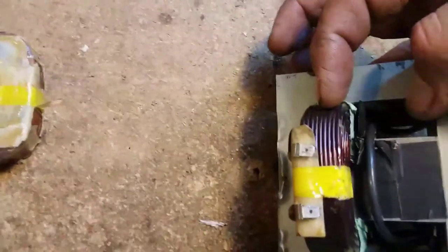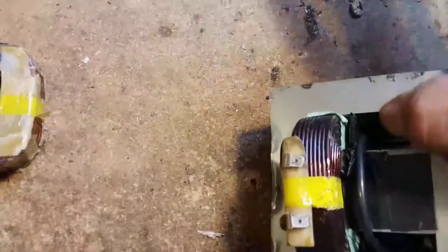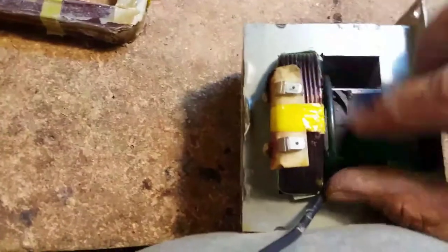The space the secondary occupied will now be occupied by our new windings. The primary winding has male connectors and that's what you're going to use for your 120-volt outlet plug-in. The coating on the wire — try not to nick it, cut it, scrape it, or damage it in any way. I've heard people using fingernail polish to fix that, but I don't think fingernail polish was made to stop electricity from jumping across wires.